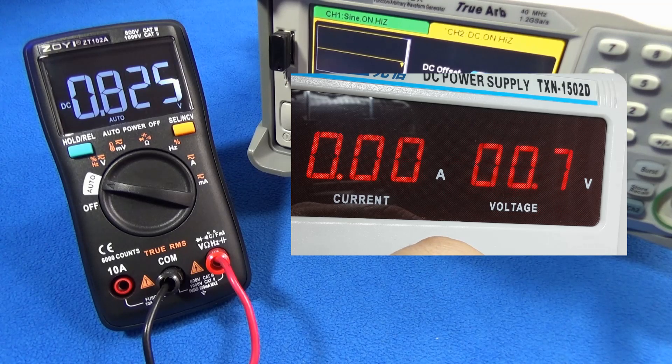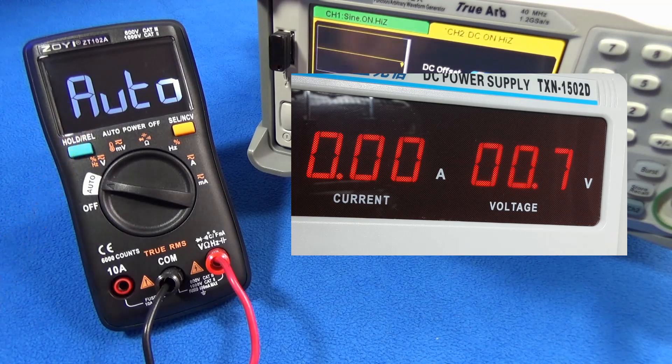Let's remember, guys: so far the multimeter has more precision than the power supply voltage display. To trigger AUTO, a voltage around 800 millivolts is very safe, because in AC or DC it's generally above the diode voltage level. So when making measurements with a triac, bridge rectifier, or something alike, the system is very safe to work with.